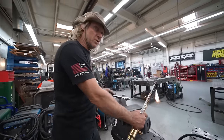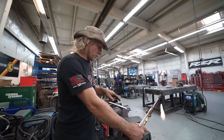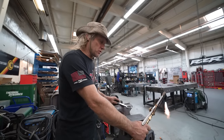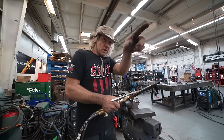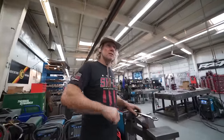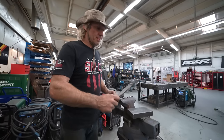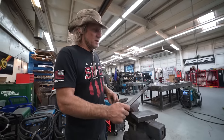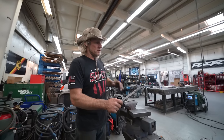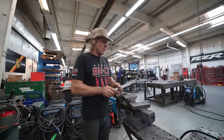So much easier if you have a kiln and you can just set the temperature. But there are guys that are really good, and they will temper different parts of the tool at different hardnesses. So you can have one part soft, one part hard. Same thing with swords. And even this anvil over here. They will temper the surface of it down a quarter inch or a half an inch, but then keep the rest of it untempered. Oh yeah, you can see it. You can see the color change there. Right in there between the red and the light blue, there's a dark blue. And that's basically the temperature that you want for this surface right here, and to leave it that way for a while. But as long as I get it there, it's gonna be somewhat okay after this.